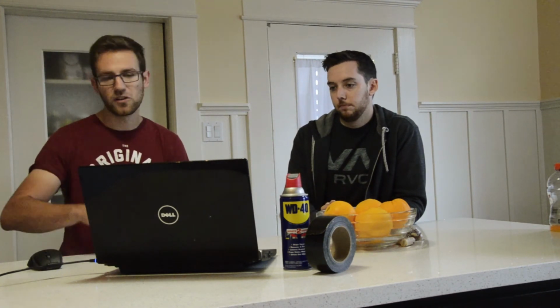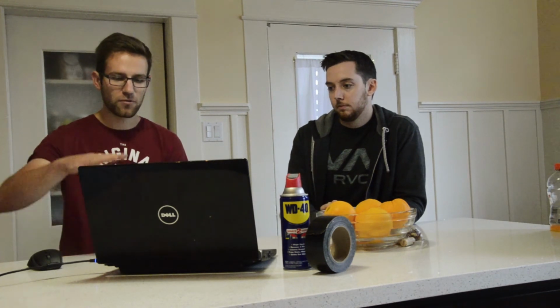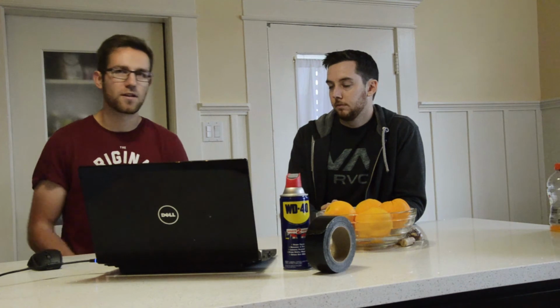The last thing we thought could be improved is the lifting speed. As you may have seen in the video, our grate is driving up and down really slow. That's due to the fact we sized the motor really strong, but therefore also really slow, just to make sure it will work. Now that we found out it's really strong, we can use a weaker motor or just a gear head with less gear, so it will spin up the wiring faster and drive the grate up and down faster.